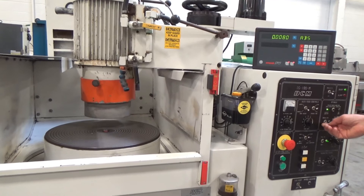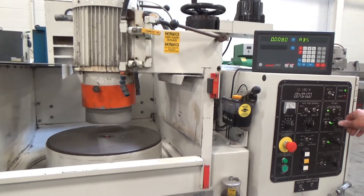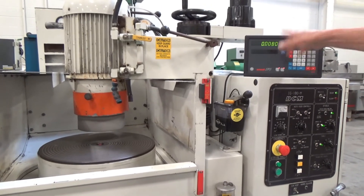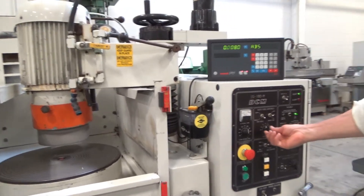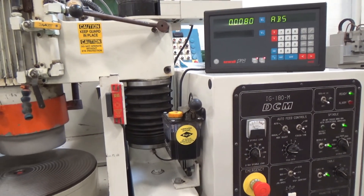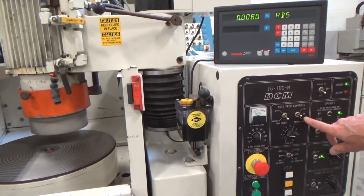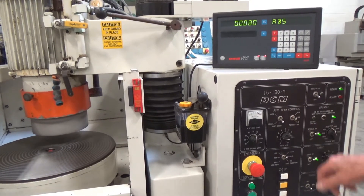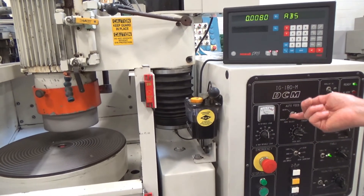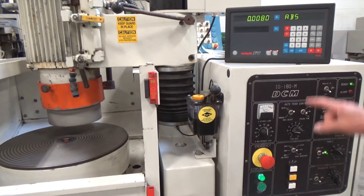Spindle up — again, 1,800 RPM. I'm going to put it at 25 and call it right there. We're still at 8 thousandths, so we can feed the eight now. Here's our pre-determined feed rate; I'll start off kind of slow — I'm not sure what number two constitutes, but we'll feed at that rate. I'll hit auto cycle start. I need to flip over to automatic mode first — there we go. Auto — solid green. We are feeding now from the 8 thousandths.